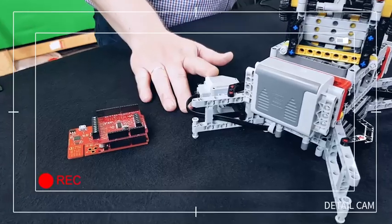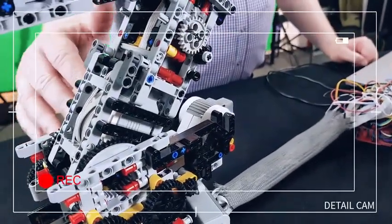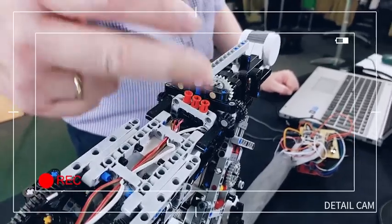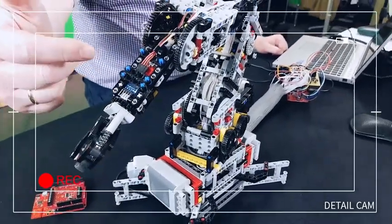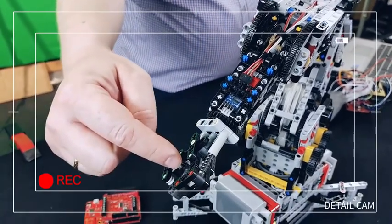After building the robot, we took this shield and the XMC1100 microcontroller from Infineon to control all six Lego motors independently. By stacking two of these shields I can control up to eight motors independently. This looks pretty complicated — can you give us a short walkthrough of where the motors are placed? We have one Lego motor on the bottom turning the table, one on the side for the first lever, one in the cage for the second lever, one at the end for the finger turn, and two motors in the cage for turning the finger up and down and rotating it.